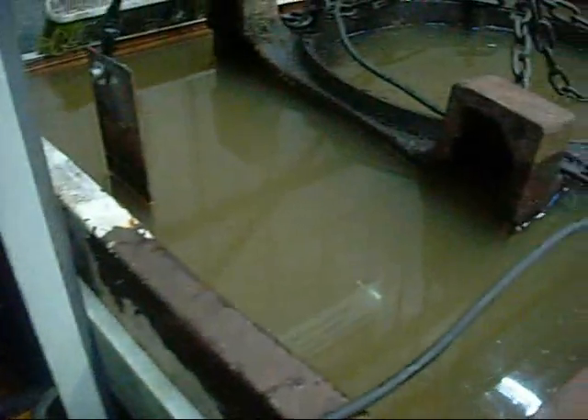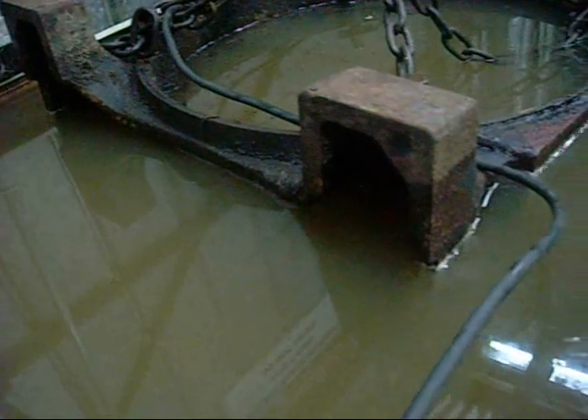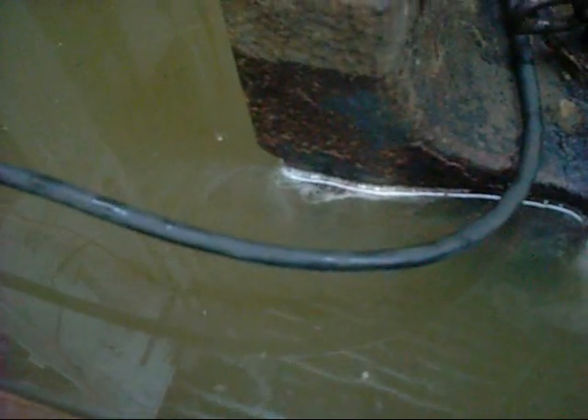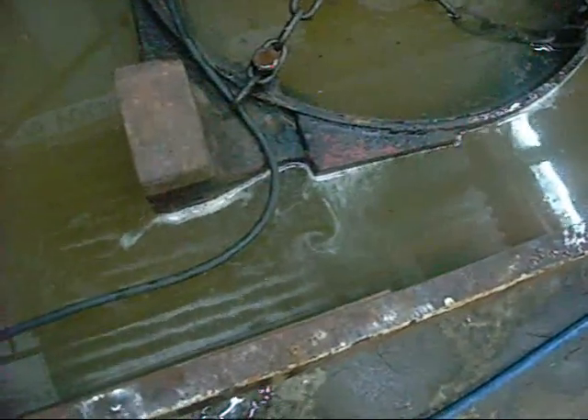Fan's up, humming. Bubbles coming up immediately. I want to see what kind of amps this thing is drawing, so I'll shut it down shortly and wire the current transformer through the primary or the secondary of the AC transformer before it goes into the rectifier stack. That way at least I'll get a rough idea of how much current is coming out of it, because it's working very quickly already.